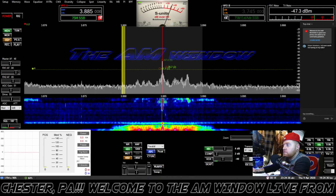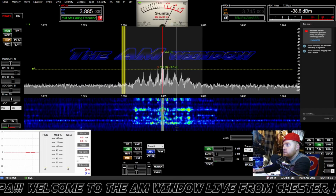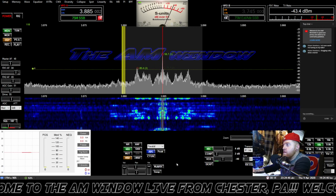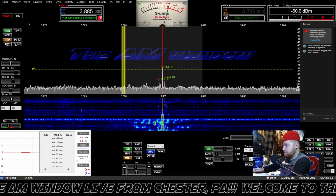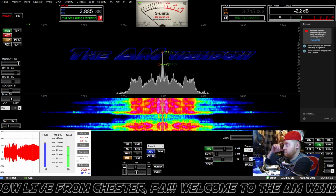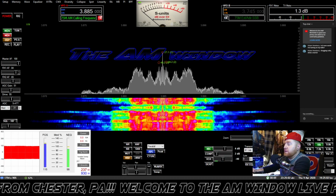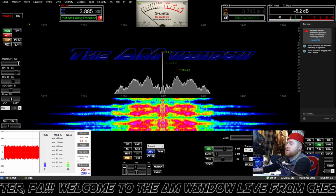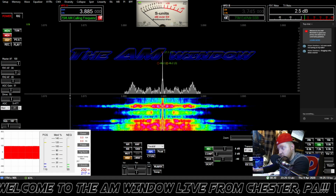Yeah, the thing with this amp is the power supply is 1 amp at 4,300 volts, and it's continuous rated. So I could just key down forever, and the thing would just hum at me. Yeah, that's great. That's what I want. I want headroom. I'm not looking to run legal limit plus. It's not what I want to do. I just want to run legal limit and be able to sit here and key down and walk away, fall asleep, come back like, oh man, hello? Is this thing working?